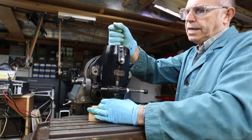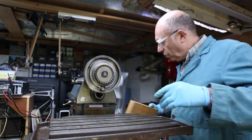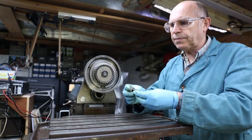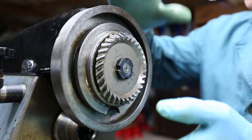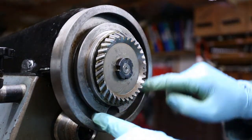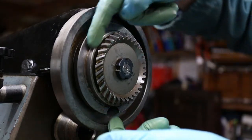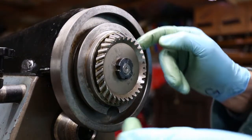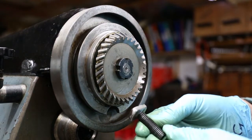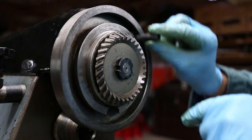Bring this forward and take the head away. Now we can see the T-slot and we can remove this original T-slot bolt which is just here. With the forward part of the vertical head removed we can now see the forward face of that large casting. You can see the T-slot is around here. The boss that I spoke about that protruded forward from the front face is this surface around here, around the outside of the bevel gear. This is the original T-bolt and you can see there's an access hole just here to get the bolt into the T-slot.